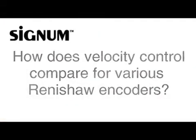Quantization effect should also be considered. You need fine resolution for a smooth velocity loop. We use dynamic signal conditioning to minimize SDE. To ensure low noise, the optical scheme of Tonic has been optimized to produce an excellent signal-to-noise ratio. The finest resolution version of Tonic has jitter levels of 0.5 nanometers RMS.